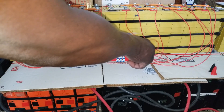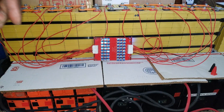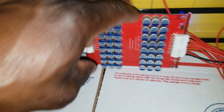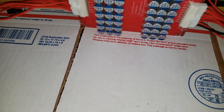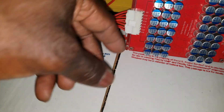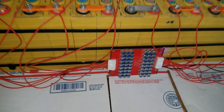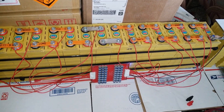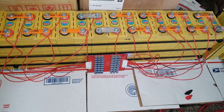Right now I don't have a 48-volt charger here, but you can see everything is working. See the blue light — it has a sticker that comes with it, 3M. Now it's balancing the cells — whichever cell is lower it's adding charge, whichever is higher it's bringing it down.